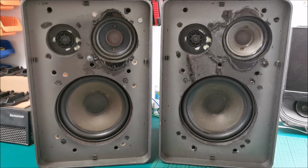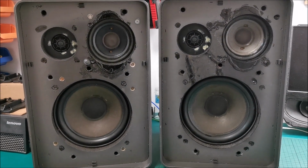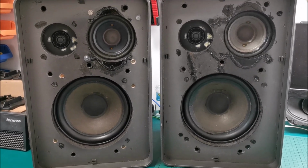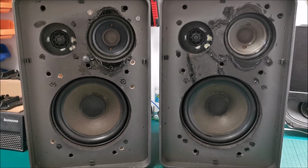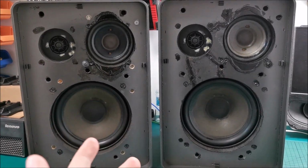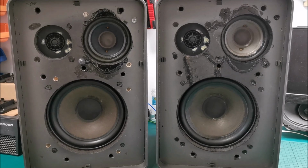And the speakers are ready to be played. They are connected in series. I want them to get exactly the same signal, and my amp could not handle two ohms, so they couldn't be connected in parallel. So series it is, to have 8 ohms. And I have no clue which is which. It wasn't even intentional. I lifted them up and I don't remember. So it's for the best, actually.